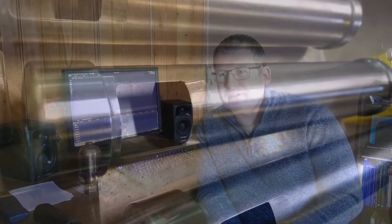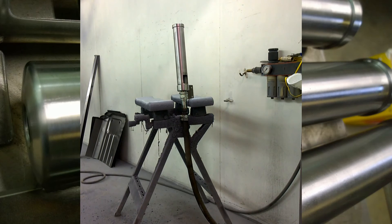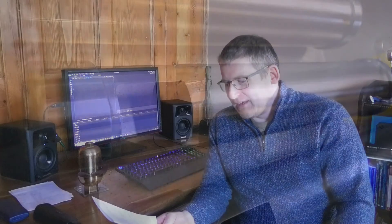Of course it's going to be very loud, so I've got my e-muffs at the ready. Because I've made plenty of locomotive whistles in the past - we've got the black five whistle, which you can see now. This is a very low pitched whistle because it's only got two knife edges over a distance of about three inches around the circumference. It's got a very long, thin chamber, so it makes a very deep note. These are used on Black Fives, typically running up and down the Scottish west coast.